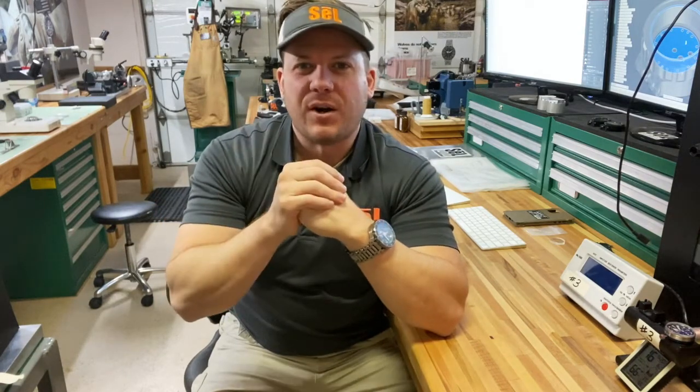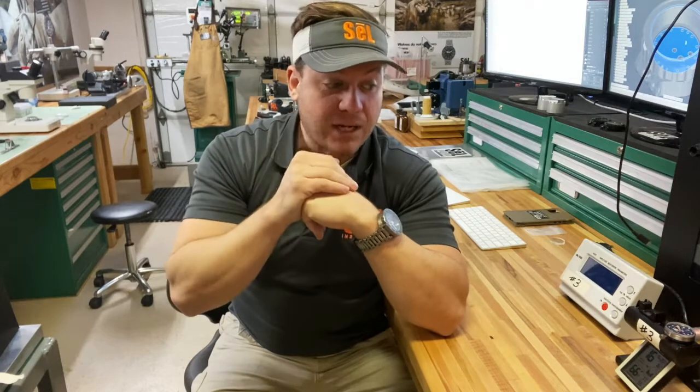The big question obviously is: how do we solve this? Customer satisfaction is a big component of what we do. Does it mean we try to explain to customers that it's a two-thousandth of an inch error and they should be happy with that? I think that's the wrong solution. What we need to do is consider how our dial designs are contributing to a perception of error — or magnifying the real error of two thousandths of an inch — and do some redesign on our dials to help contribute to higher customer satisfaction. It's basically impossible to align the bezel and dial to better than two thousandths of an inch without dramatically increasing cost.